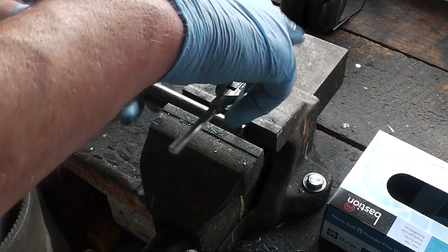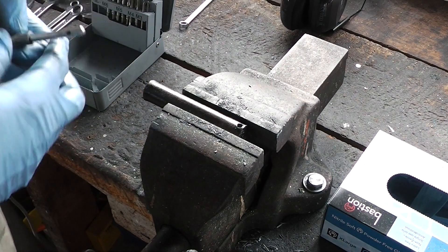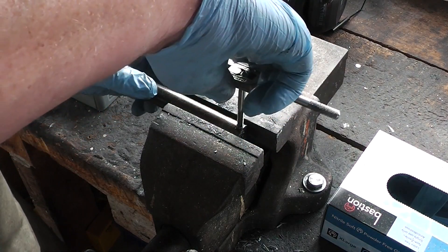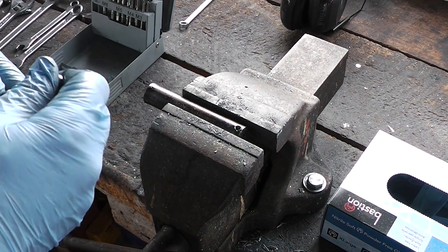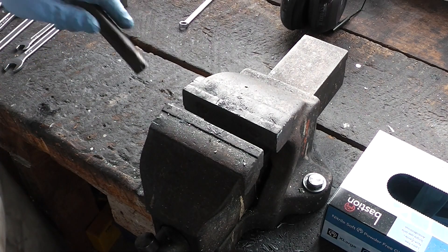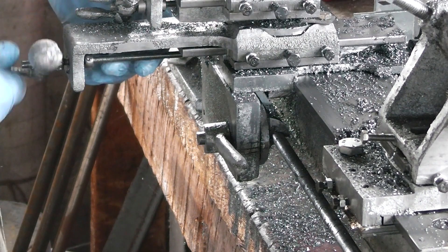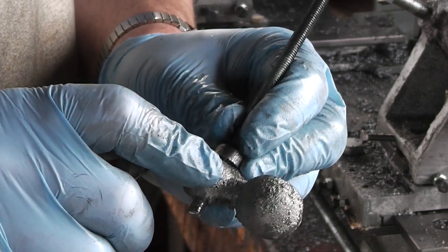Tapping steel — so I'll start with the number one tap and then the final tap. At some point I'm going to have to buy a big bag of M6 grub screws. Right, chuck that up in the band saw and get it to cut through it. Well, that's doing its thing. Let's undo this — well, this shaft collar hasn't done too badly for itself.